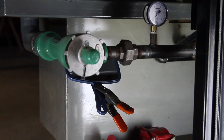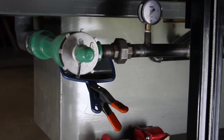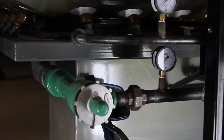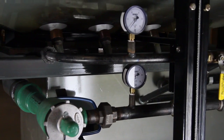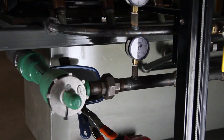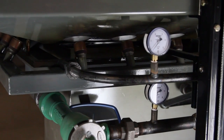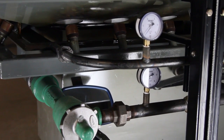The mirror gives you a view up into the burner ports, which are under the kiln. By standing right here, it's equivalent to laying on your back looking up at the bottom of the floor. You can see the color of the flame and, to a certain degree, the intensity of the flame.